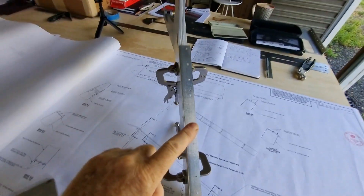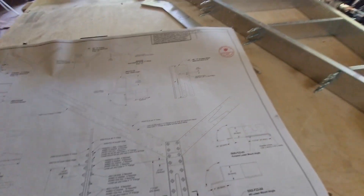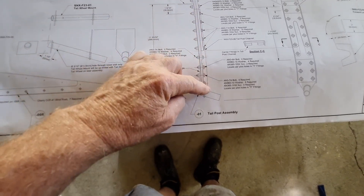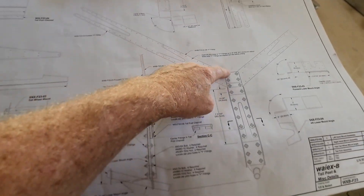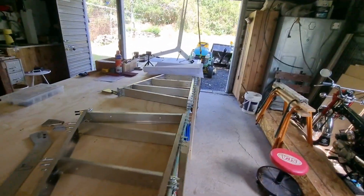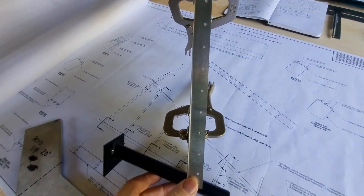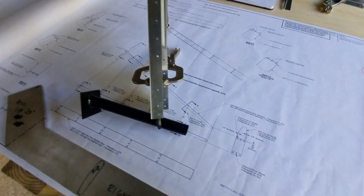This section here is the last rib. Here's another really good detail of it all. So this rib is just sitting in here and you can actually see the layers of the spars — one, two, and a little tail post spar that fits in here. It's all bolted together and integrated with the fuselage. I've only got two clamps on this thing and I can just feel the rigidity of it already — it's quite strong, very strong. It's going to take a lot of impact load from the tail wheel if you do some dodgy landings, but hey, we all do them.